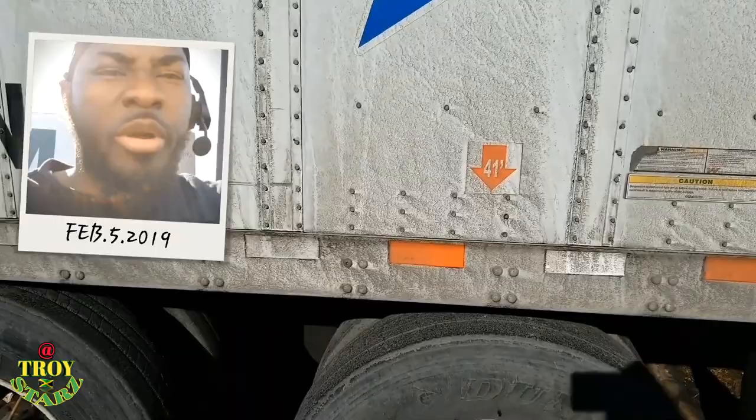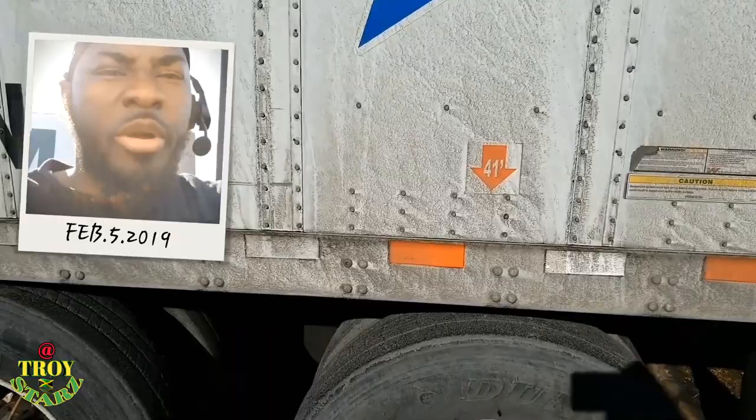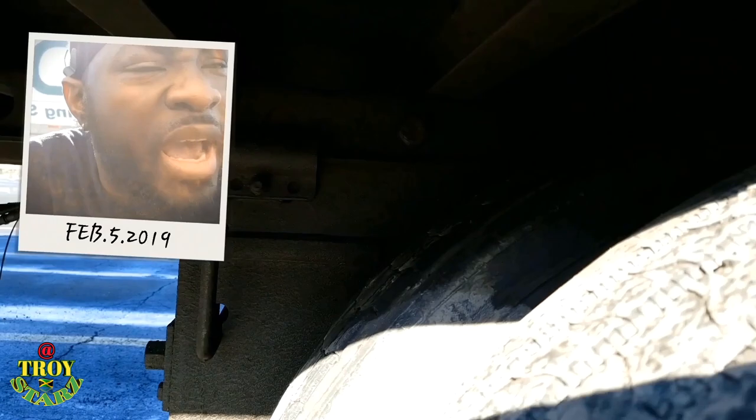If you can see the 41-mark — the 41-mark is right here on the trailer. The trailer is actually at the length where it should be; I can't go any further with the trailer. As you can look under the truck, you can see where the pin is. The trailer is locked and secure — it can't move any further, so we're done with the trailer. What we need to change now is the actual weight on the drive axle.